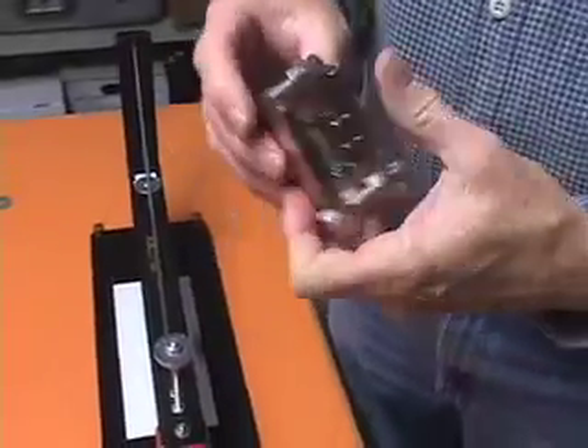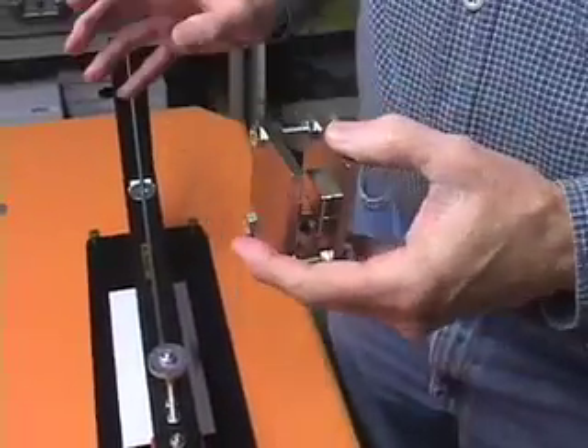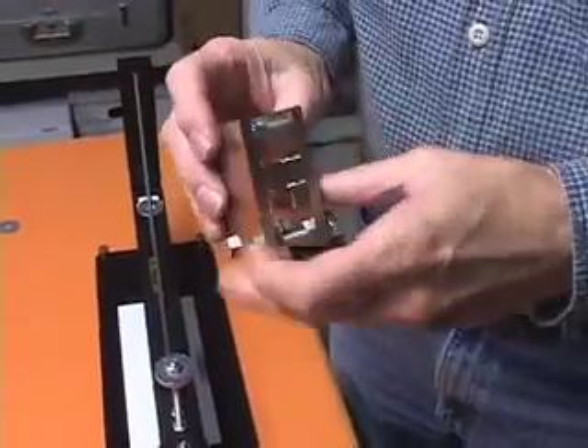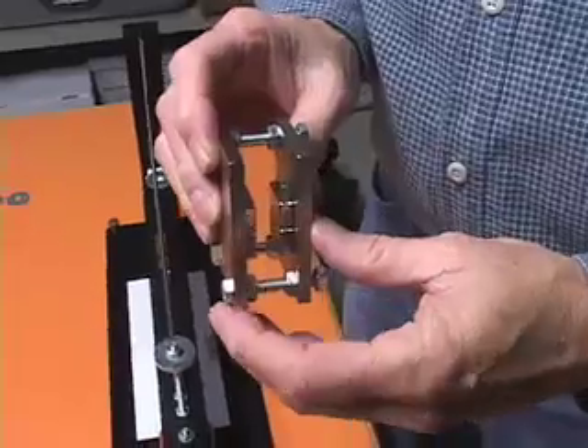If you're trying to adjust the damping and you find you cannot get enough damping — in other words the overshoot is always greater than half a millimeter — then you may have to move these magnets closer together.